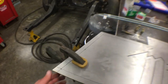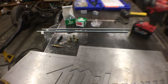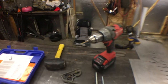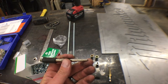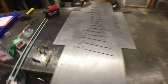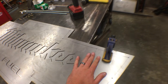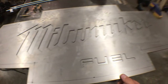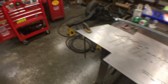I went ahead and pre-drilled with a little eighth-inch drill bit all the corner spots and wherever I want my bolts to hold this sign apart. I used a punch for a lot of this — every time I made a mark I went ahead and punched it, then used the eighth-inch drill bit to pre-drill the holes. The punch keeps the drill bit from sliding around. I went ahead and clamped it, marked back three-quarters of an inch. When marking signs there's a little trick to marking lines nice and straight using a tape measure.